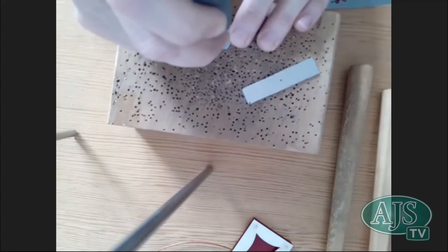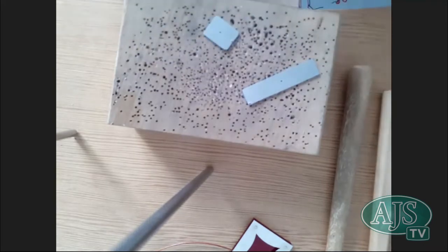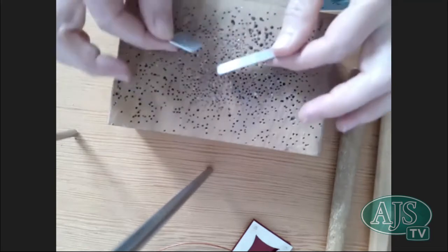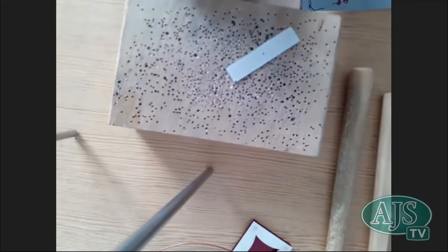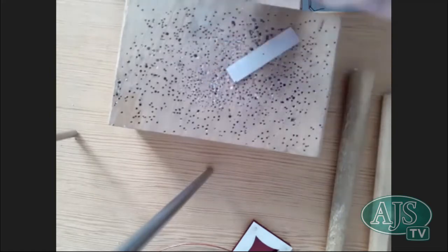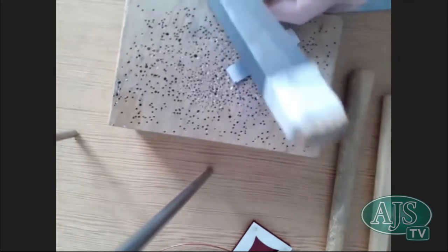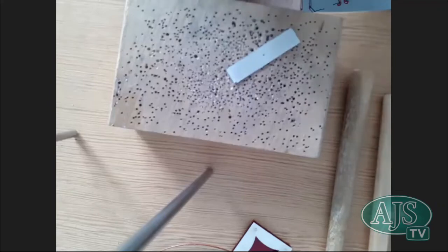So, drilling through. Because it's aluminium and a nice sharp drill bit, it's a nice clean cut quite quickly. If you're drilling through some harder material, using some lubricant, like Burlife or something like that, would definitely be beneficial. So I've got my two pieces of aluminium drilled. I would recommend cleaning up any burrs that might occur from the drill, so that you've got a nice flat surface for the wire to go through.